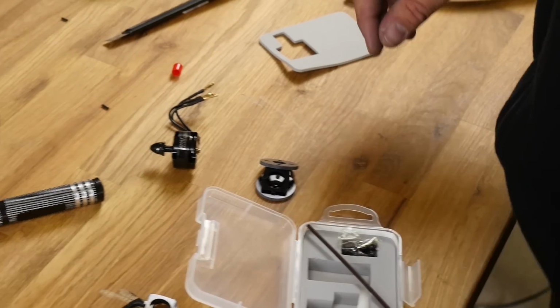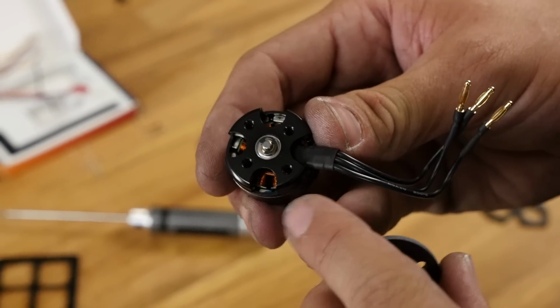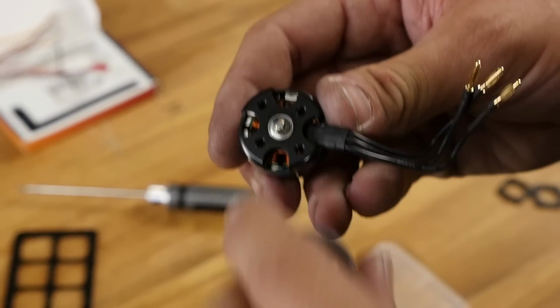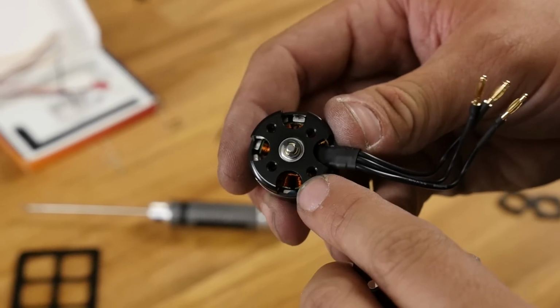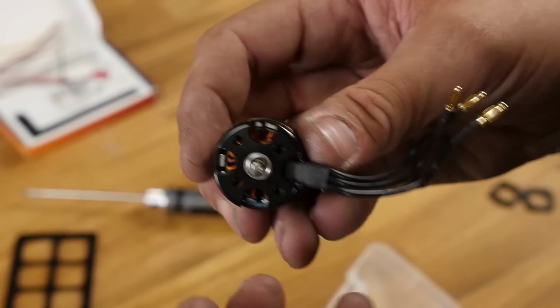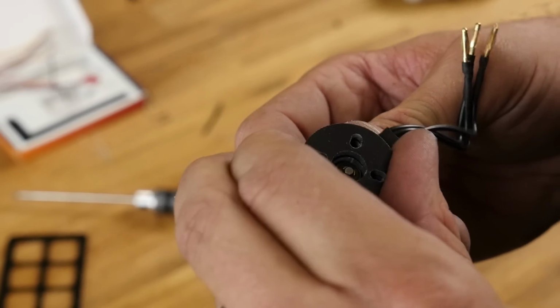To do this, we're going to grab two 25mm screws. Now before we go any further, we're going to want to take careful note of the spacing on the screws. We're going to want to put our screws through the 19mm holes. That's going to be the farther the two apart. If you put it through the 16, you'll scratch your carbon fiber boom. We're going to lay this right over top.